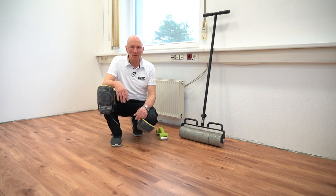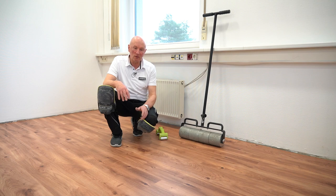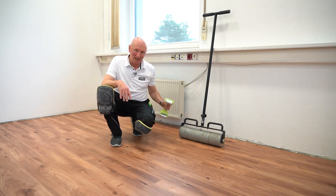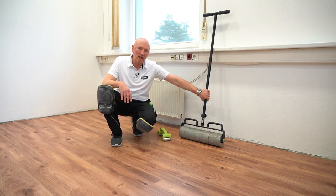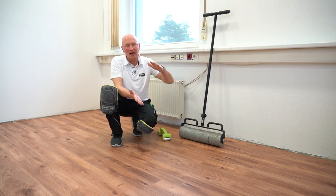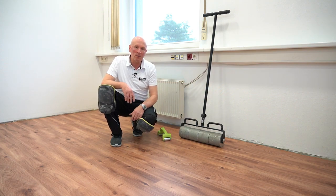You can see how quickly such an installation works with our single glue self-adhesive mat and our Vinayo 1000. We still have to rub the edges with the help of our pressure roller, and then use the heavy section roller to rub the surface so that we get the right pressure from the covering into the adhesive. This is what gives us a permanent bond that can no longer be separated.